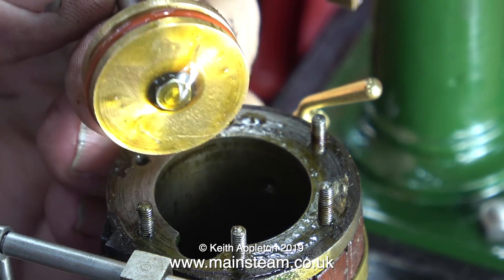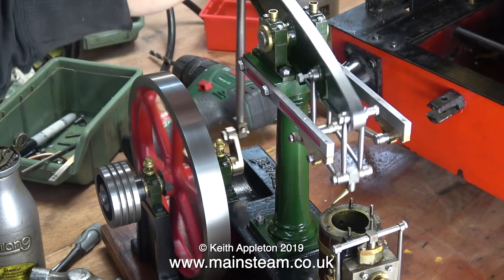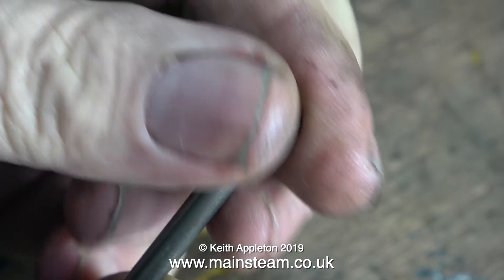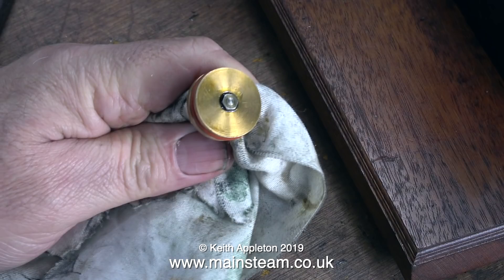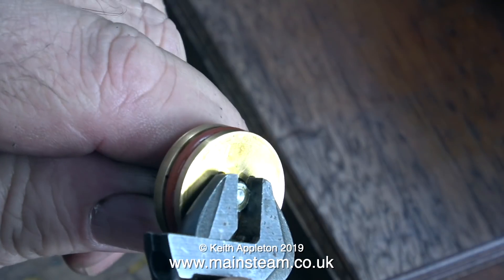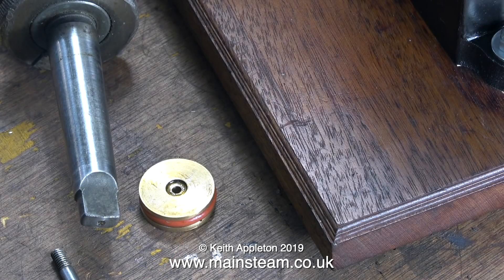In the next episode I'll be making a complete new piston — this one is unserviceable. To show that the engine is fairly free I turn it over by hand; it's a bit like a sewing machine treadle, but apart from some tight spots it runs okay. This shot is a bit out of sequence, but as you can see, the position of the lock nut didn't leave many threads to engage the fitting where the piston rod meets the Watt's parallel motion. The end of the piston rod is reduced to fit into a small hole in the piston, and only the end of the reduced part of the rod is threaded to take the lock nut. I'm going to dismantle it so you can see how it's put together. To do this I'm clamping the rod in a tailstock chuck, then I can use my trusty Bahco spanner to remove the lock nut. When I make a new piston and rod assembly I'm not going to make it this way at all — I'll show that in the next episode.